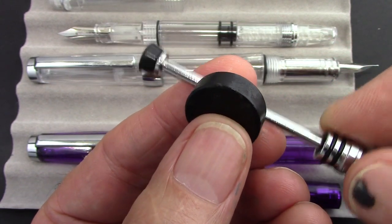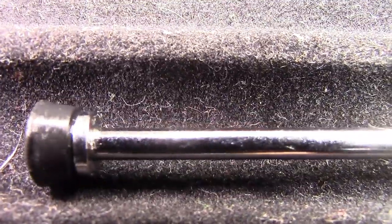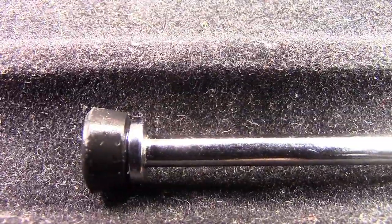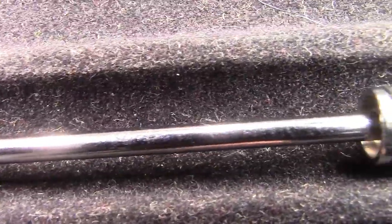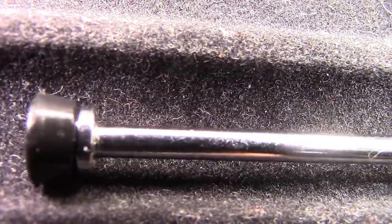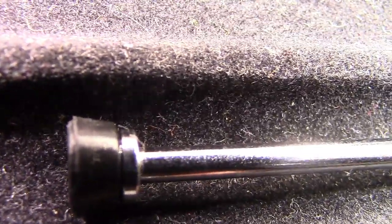So right away, it's not made out of steel or iron. It could be an alloy, but I kind of doubt that. When I look at this rod — and I've looked at it under a loupe — the surface is not really as smooth as you would expect, and I would say it has a little bit of pitting on it. So my guess is this is a brass rod that they've plated with rhodium plating to match the trim of the pen. That's why it's not magnetic, and that also indicates why it may pit, if certain liquids attack the plating or if the plating has some flaws in it.